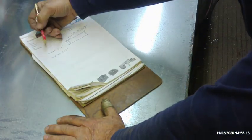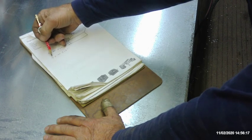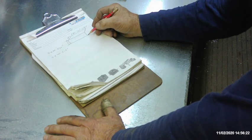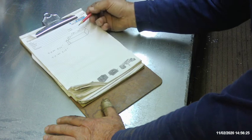Hey, good afternoon everyone, it's TrackMan44 here. I thought you'd like to have a little bit of a refresher on making just a plain piece of straight duct — I've got to knock out a couple of them real quick, just two little short ones. This is just the way I do it; there are any number of ways of doing it. I've got written down 9-inch by 20-inch by 36-inch in length, and 9-inch by 20-inch by 18-inch in length, with a little isometric drawing of a generic piece of duct with those dimensions on it.